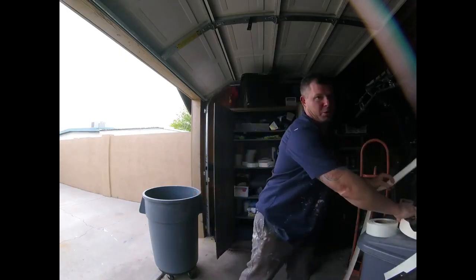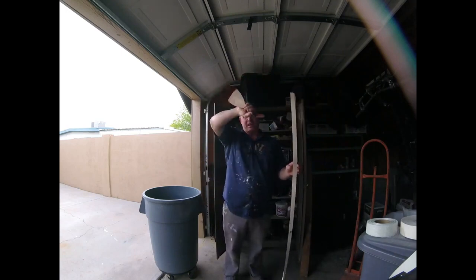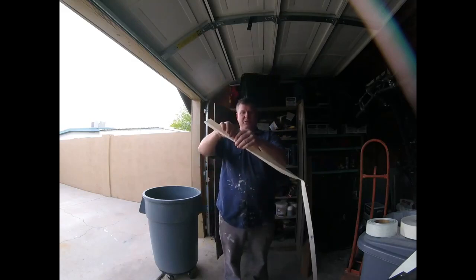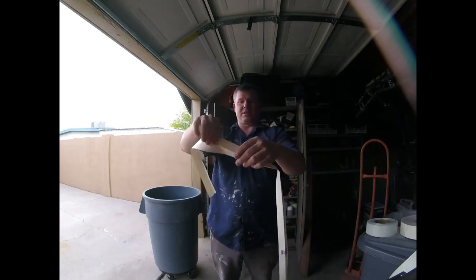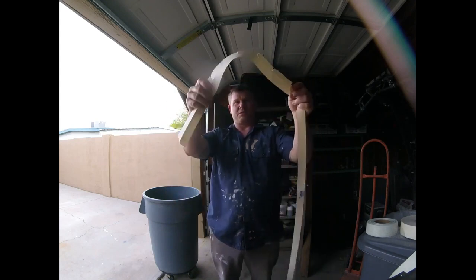Like I did a job where it was a round wall, like an arch wall. With the fiberglass, it's kind of hard to do a round tape. So whenever we do a rounded wall, we like to do what's called a tear tape method. We just take these little tabs, and maybe every inch or so, we do little cuts, little cuts, little cuts. And then that creates an area where you can actually bend the tape.